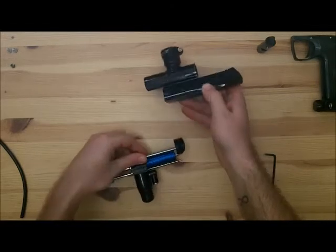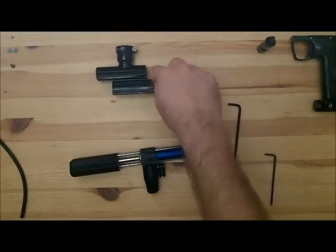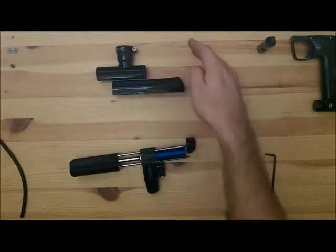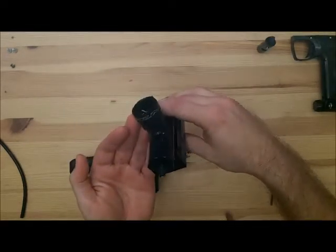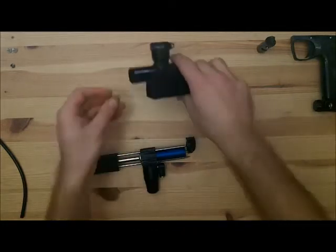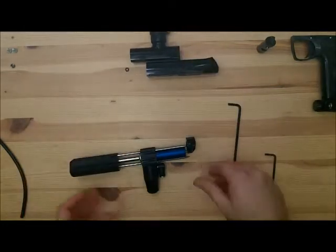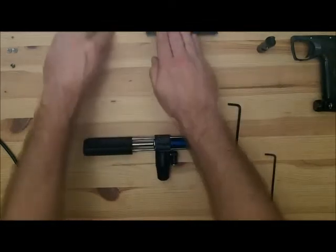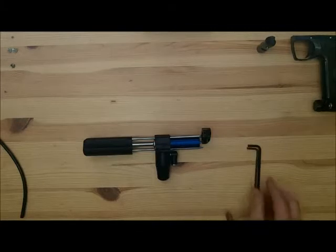So what you've got left then is the hammer, IVG, which is internal to the hammer, and the spring left in here, and probably the detent O-ring, actually that was taken out earlier, which is going to be in there. And then you've got this assembly sitting in front of you. So I'm going to set this body aside just for now, and we're going to take apart that. So two Allen keys, a 1/8 and a 5/32 thus far, to get this far.